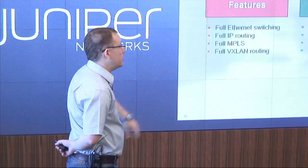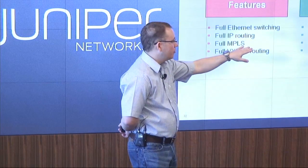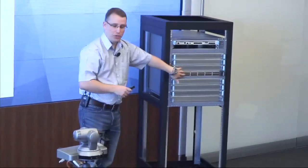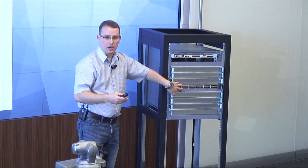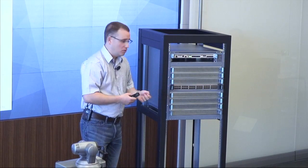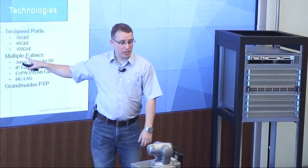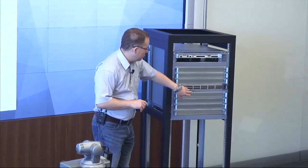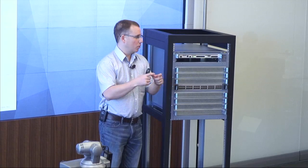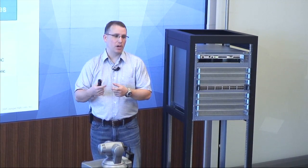The technologies — it's tri-speed. It's 10 gig via a breakout cable, obviously. It has native 40 gig. I have a line card here — we call this a 36Q. It has natively QSFP 28 ports, 36 of those. Breakout cables can go into a 4x10. We also have 100 gig. You can turn these ports into 100 gig, and I'll show you how we do that. We have little port groups, and for every three ports, we can turn one of them into 100 gig.